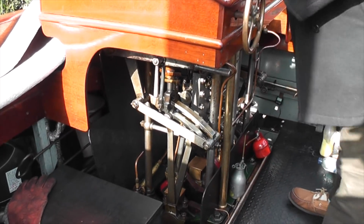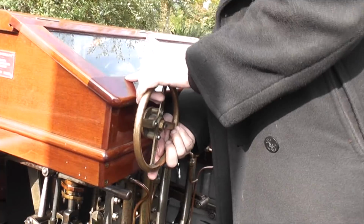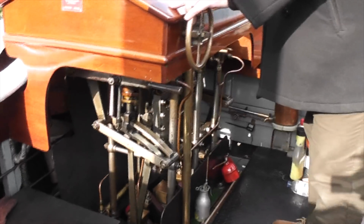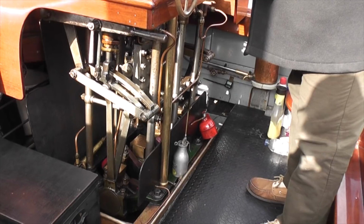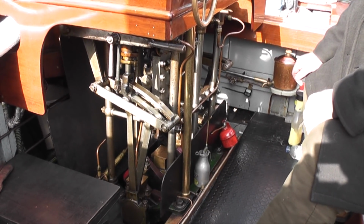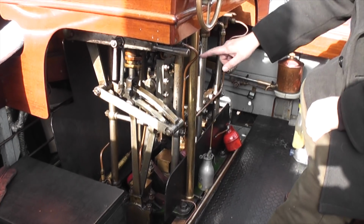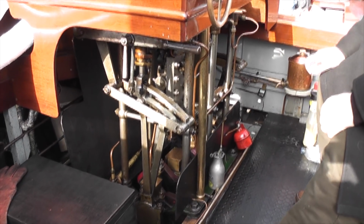Very rusty. Right, tell me when you're running. I'm running. Make sure all the drains are open, so that lets any water out of the engine that condenses in there, and you slowly crack the main steam, the throttle, to let steam into the engine. It's slowly warming up, won't move straight away, you're just letting steam in, just warming everything up. And any water that condenses in the cold cylinders goes down to the engine drains and then out to the tun dish, on the small injector that then drains into the ash pan.